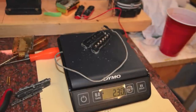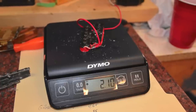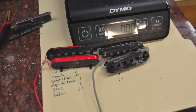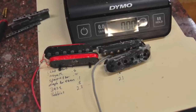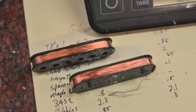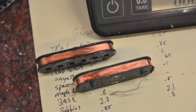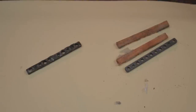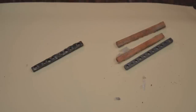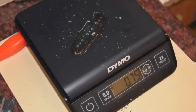Let's weigh the bobbins: 2.3 for the Gibson set and 2.1 for the Chinese set. There's a little more wax on the Gibson set, but I was still surprised by the weighting. The bobbins are a little bit thicker for the Gibson set. The Chinese pickup uses legs to sit correctly while the Gibson uses wood spacers. The metal spacers were similar, but the Gibson one was much more refined.